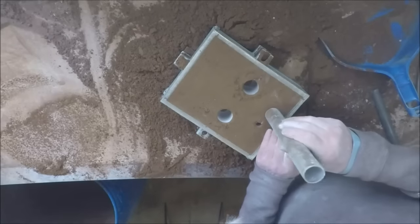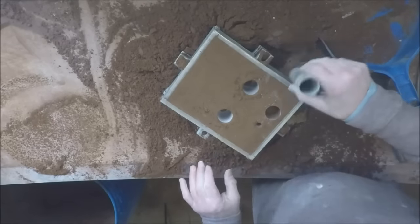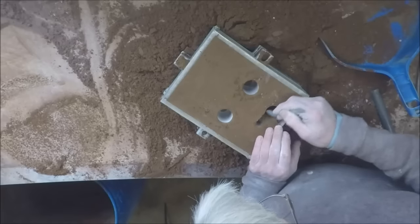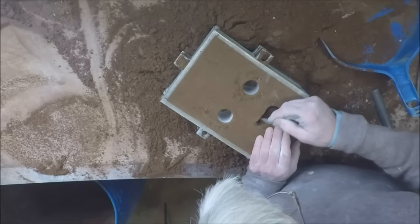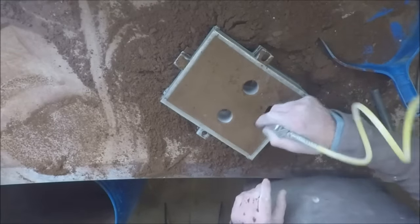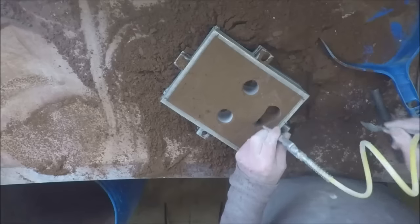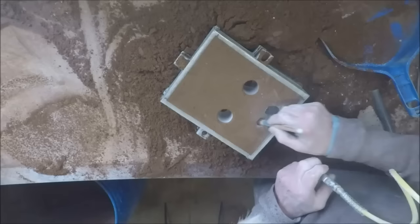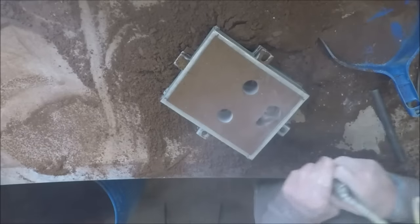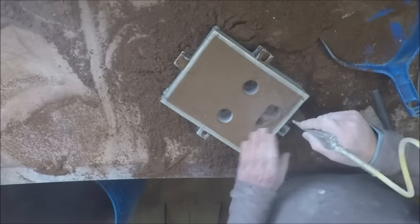Now we'll cut the new pouring basin. A little bit deeper there, maybe. Now, radius it up there, down to the sprue, get a good radius on that. A little bit of a radius on that side, but that's not as important. Right. And just around the top edge. One nifty little pouring basin cut.